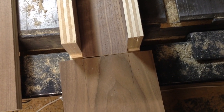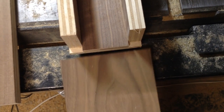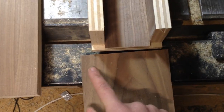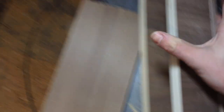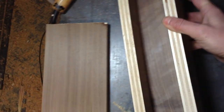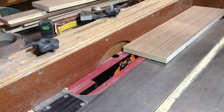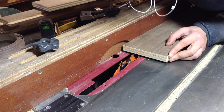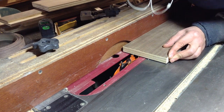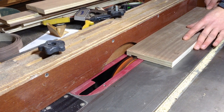For the front I marked center and have to take out quite a bit of material on the sides because I want this to be inset — I didn't want a big thick piece of walnut sitting on the inside of the frame. I also marked how tall it's going to be, because the front isn't as tall since you have to leave space for the gearbox of the actuator. I start toward the center and remove material on the sides so the whole piece fits together.